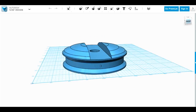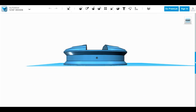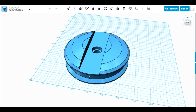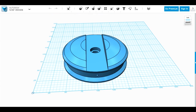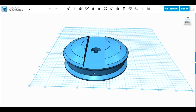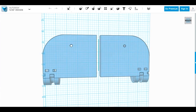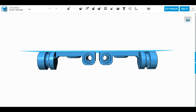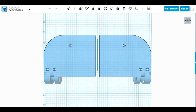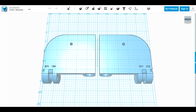So let's have a look at some CAD. Here's the first part for the back opening mechanism — a kind of pulley with a hole in it, with recesses for two bearings so it turns smoothly. There's also a channel cut through the middle for a piece of wood to fit in, which will hold the frame for the back — probably a combination of 3D printed formers and foam for the panels. There'll be two of these panels which tilt and open away from each other. Next up are two plates with pivot points; the pulleys mount on the front of them, and they have another pair of pivot points with bearing recesses so the two pulleys can tip away from each other, meaning the two sticks act rather like gullwing doors, sticking out at an angle as the pulleys turn.